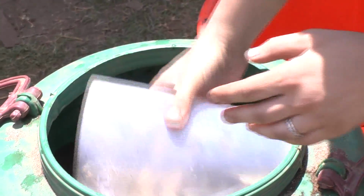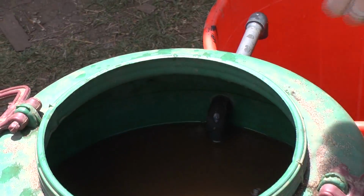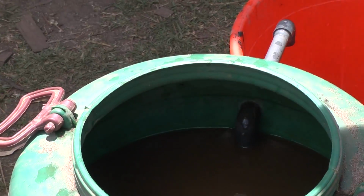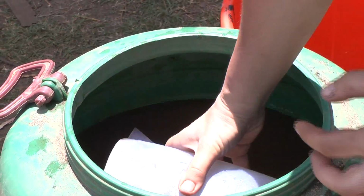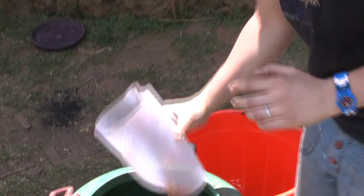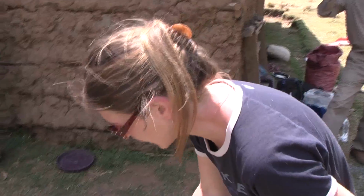If somebody does accidentally dig into the sand while they do this, then that sand does need to be replaced. Because we don't want the depth of the water that stands above the sand to ever be more than 6 centimeters. Ideally, it's just 5 centimeters.